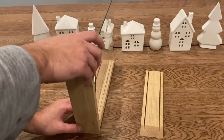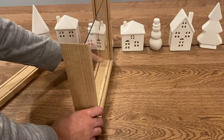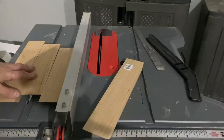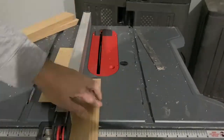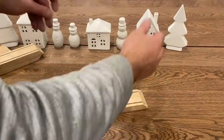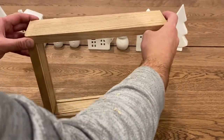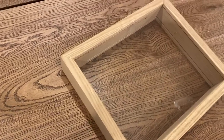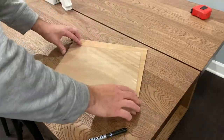I went back to my glass piece and saw that we were getting very close, but things weren't fitting right just yet. The grooves needed to be cut a little bit deeper. I raised the blade a little bit and gave each piece of wood another pass. I went back to test the fitment one more time, and it looks like we're all set. And once that was wrapped up, I finally had a chance to focus on the back panel.